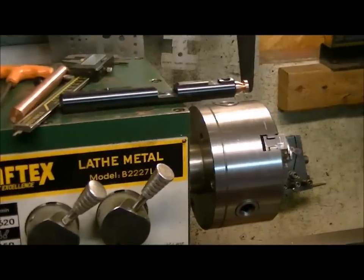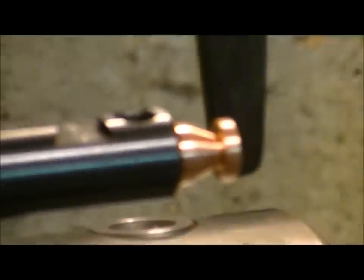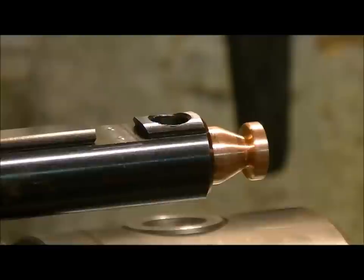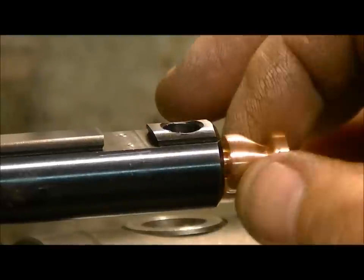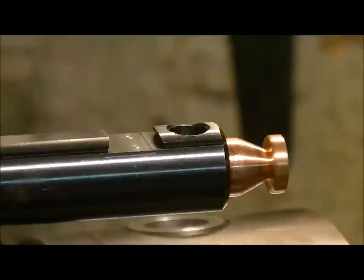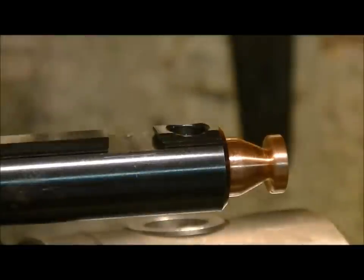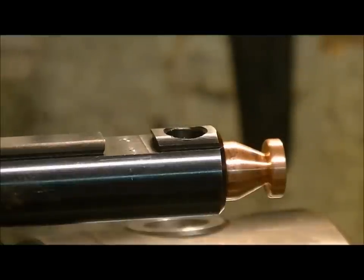Here's how she's looking so far — I've got her in the back of the breech. There we go, it's a very nice fit. There's very, very little play, which is what you want. When we go to drill this, we'll set the breech up into the drill press, line up the drill bit, hold this in, and then just drill right through and clean up the excess.